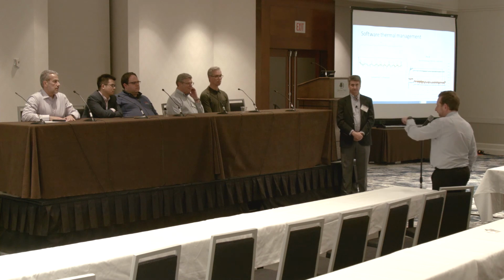Hi, Robin Bornoff from Mentor, a Siemens business. There was talk then of reduced order models. And Annie, going back to your point about the need to be able to determine unmeasurable temperature points: a model of the phone that is part of the thermal management system that could be used in operation is a great opportunity to take known properties, such as known temperatures and known powers, and from that model provide virtual sensor outputs to predict the temperatures you're actually interested in controlling. To do that, the phone is going to have to know a little more about its environmental context, to be able to do that type of prediction.